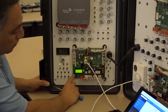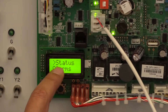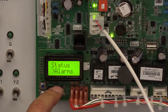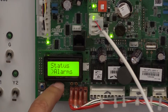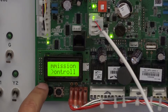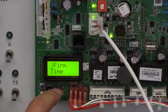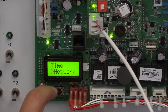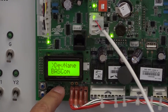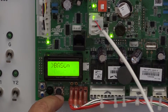I'm going to walk you through the menus here. You can see the top layer — usually showing status. There's a little joystick on the bottom; you can go up, down, left, and right. I'm going to go right all the way down to what we call 'Controller,' hit the Enter button, and that takes me to level 2 of the menu structure. Then I'll go down to 'Network' and hit Enter again. Now these are some of the BACnet settings. I don't have to do anything with the BAS comp — this has already been set for me.